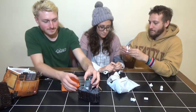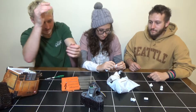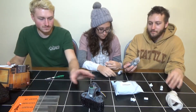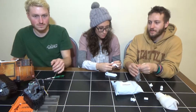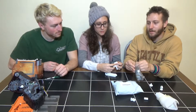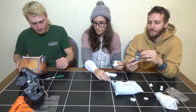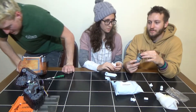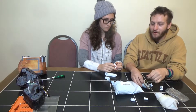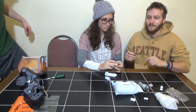There's the motor, and you can see the encoder right there — yours may or may not have that. These are the new motors — a higher RPM version. The old ones are around 35 RPM; these are around 160 RPM. We're also not using the motors that are specced for this build, so we'll see how these higher RPM motors do in terms of torque. They have about one-seventh the power of the recommended ones. This thing is also super top-heavy, so it can't really go on any inclines anyway.